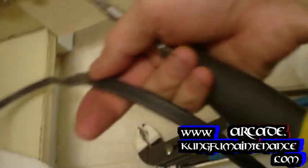Now we can move the disposal down, like so. Our cord's not in bad shape, we can reuse it. This one, the cord has already partly come out. Usually this gets locked in underneath, but it looks like someone didn't bend the second tab out underneath this portion. Once you put this in, then you have to bend this tab out. For our purposes, it's just going to make it easier to do a new one. Looking at my cord here, everything looks in good shape. No breaks in the insulation, so I can reuse this.